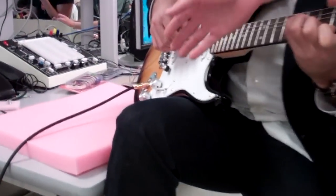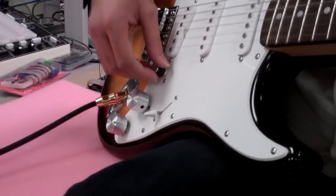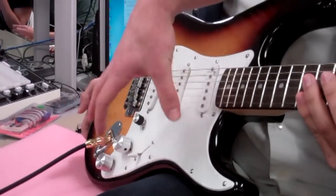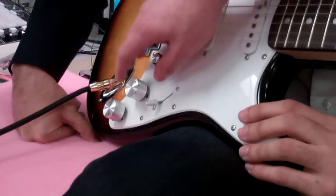What we made is a digitally controllable electric guitar. What we did was we took out the internal circuit of the electric guitar and made everything digital. What you can see here is, instead of a knob attached to a potentiometer, we have rotary encoders — these knobs. Inside the guitar is all the circuitry for the rotary encoders, and each one is communicating with the microcontroller.